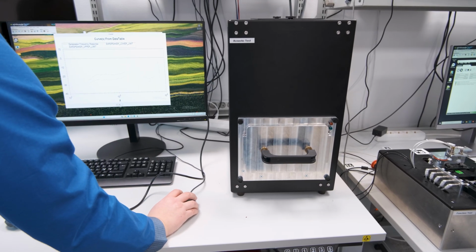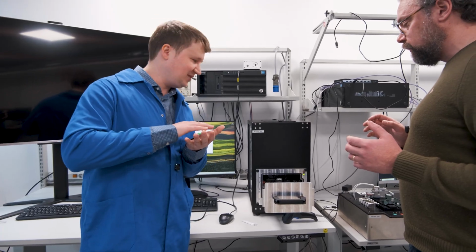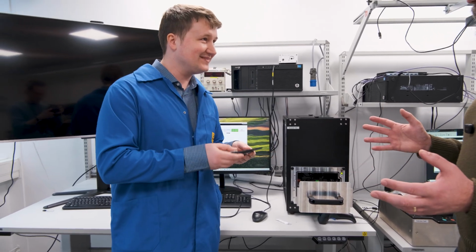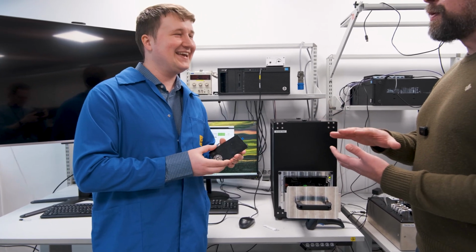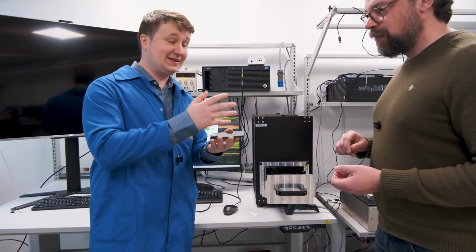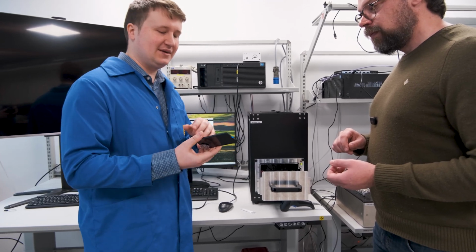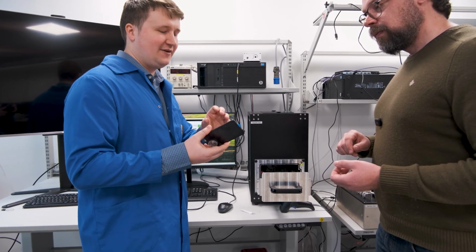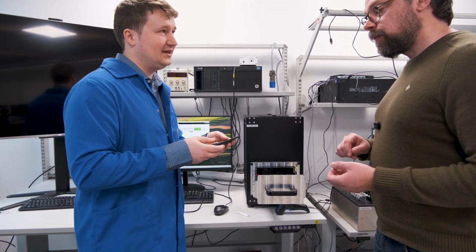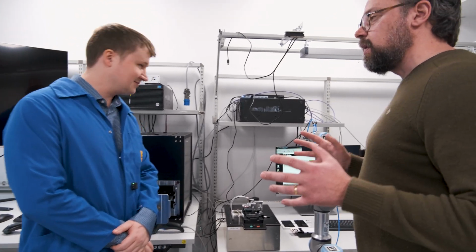Yes. So here we see that previously it was pure PCBA. Now it's box built. Box built, that's like the finished product almost. Exactly, it's almost finished at this stage. So we've put the plastic casing in this case over, and we want to make sure that the microphones or the speakers have been aligned exactly how we want them, to ensure that the quality of the product is as good as we want it to be. So once you've done with acoustic testing, then what happens?